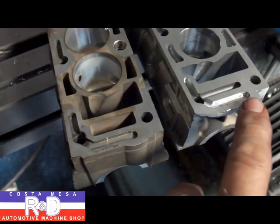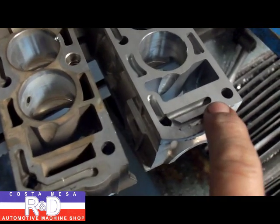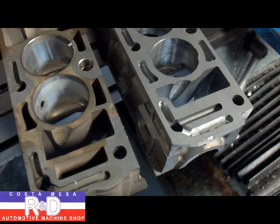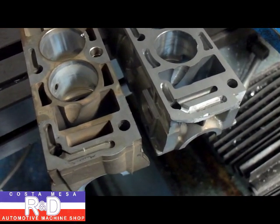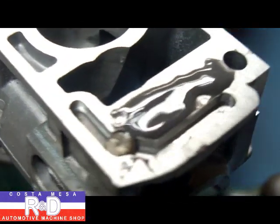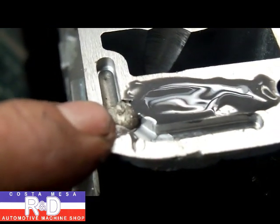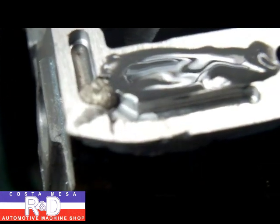As you can see, we have our new slide over here for oil. Now we're going to take and put a little bit of epoxy in this one here to kill it off. I didn't want to have to weld on it and distort this cam box a whole lot, so the last thing we'll do is put some epoxy in there. I've got the epoxy all set up and I've added a little piece of clay right here so that it'll block that hole and keep the epoxy from flowing down into it.